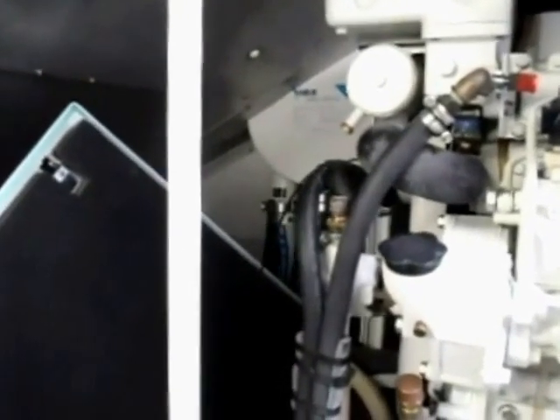See that right there? We've got a little bit of corrosion going right there. That could be from a couple of things — one is that this pump is leaking a little bit around this seal. Right in here behind this shaft is a seal that prevents salt water from going through this shaft and coming out. What happens is if you keep ignoring this little corrosion, this gap will fill up with salt water and it'll start putting seawater past this shaft and drop down and fill up the engine with saltwater. That's the purpose of that gap. I see there's a little bit of corrosion there, which tells me there's been a little bit of water that's leaked through. I'm thinking the whole seawater system was kind of clogged because the impeller was coming apart. This also tells us we should probably do this on the other generator, otherwise we'll have to do it at sea.